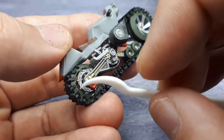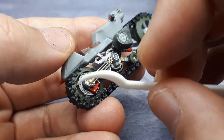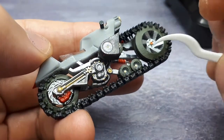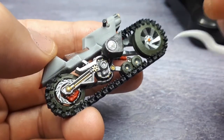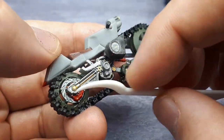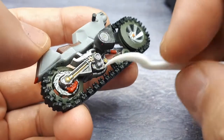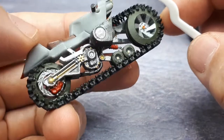And then here's the perimeter braking system again, which is on my road concept. The reason for perimeter braking is it's a bigger swept surface, so the brakes don't get too hot. There's no front brake. If you think about regular snowmobiles, they don't have front brakes either. They just have skis. So all the braking is done in the rear wheel in this case. But it also doesn't need front brakes because the entire track is touching the ground, right? That's a lot of traction. So as long as this thing can stop the tread, it'll be good.